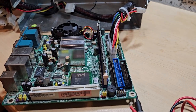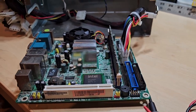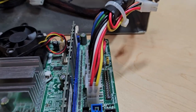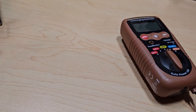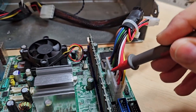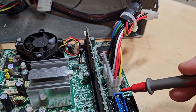And this is what I came up with. Now that I've stepped into the future, I no longer have the Fortis 400 MC opened up and disassembled to show you what I did, so we're going to use a substitute. I have this computer that's out of the Conix 500, and here's a connector — this is exactly what we've been testing in the Fortis 400 MC. The problem is, how do I get the probe from the voltage meter into the connections? It won't fit. There's no way I can get in there unless I unplug them and expose the connectors on the inside. Sometimes the voltage I needed to check was coming from the other side, and it wasn't going to work. So what I needed to do is get to the voltage and then take the other probe and just touch it to ground — that would tell me whether the voltage was there or not.